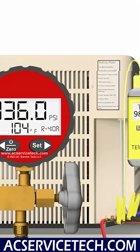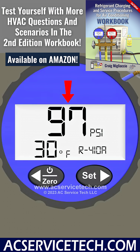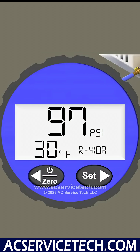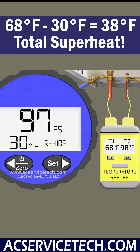If the system is equipped with a piston orifice, we need to check the refrigerant charge with the total superheat method with the blue gauge. We're measuring an R410A pressure of 97 PSI. We convert that to the R410A saturated temperature in the middle of the indoor coil and it's 30 degrees Fahrenheit — that's below freezing, that's a problem. We're also measuring a line temperature of 68 degrees Fahrenheit, so we take 68 minus 30 and we're left with 38 degrees of total superheat. That is a very high superheat.